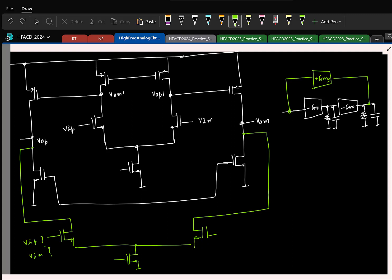How do you decide that? So let us say you change the input here — let us say the input increases. What happens to Vom1? That reduces. So if this voltage reduces, what happens to Vop? That is why I have also labeled this as plus and plus. So this path is providing a positive contribution — if I increase here, this will increase.